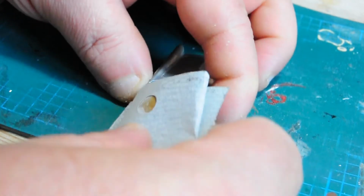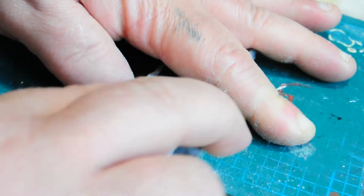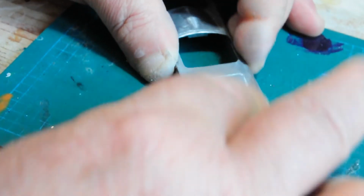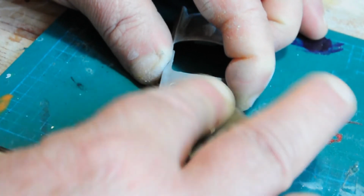Anyway, here I'm sanding off the filler with what amounts to production paper. It's fairly, for the size we're working in, a coarse grain, but for normal projects it's fine grain really. And I brought it down to here, something like 1200s wet and dry, just to get it smoothed down.